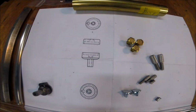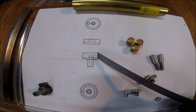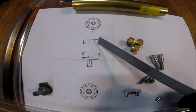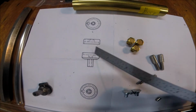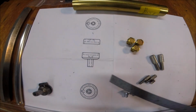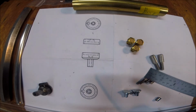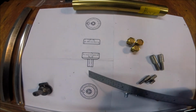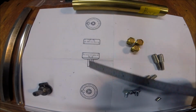So here's what I'm thinking for these drip oilers. We'll start out with a little brass bottom cap that'll insert into the headstock. Bore it out as well with the top cap to fit this plastic tubing I got. 7/8 on the outside, I think it's 3/4 on the inside. So 16th wall. Once we compress everything, that should be decent. Hopefully I won't be hitting the thing with anything. So I'm gonna use some of that stainless over there to make your post here. Probably one of these to tighten everything together.